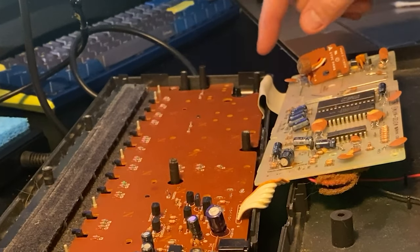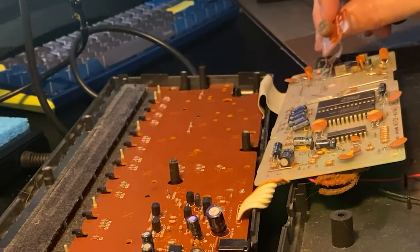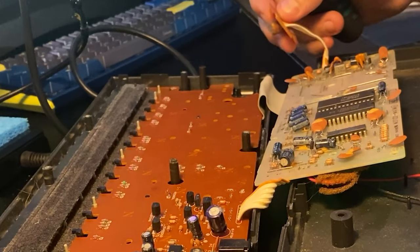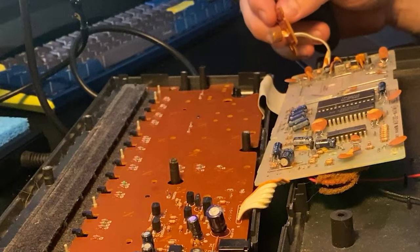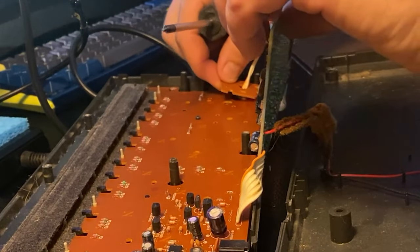Next, we'll put this board back in. This part's a little tricky. Over here, there's a hole. That's where this microphone sits. And then this loose board sits on top of it and holds it in place. And then the rest sits on top of that. So I'm gonna try to start that first. Remember to be careful of your ribbons. They're a little bit brittle at this point.